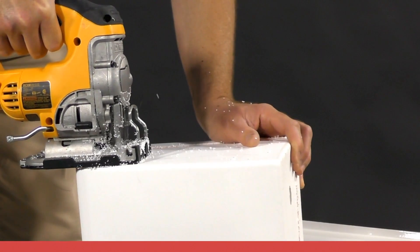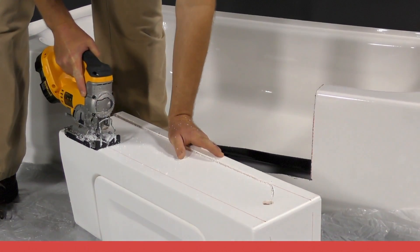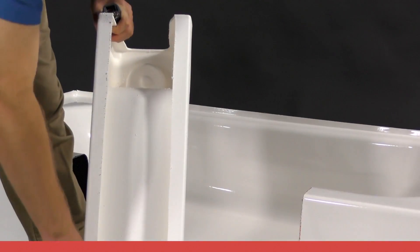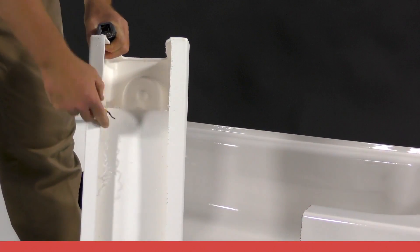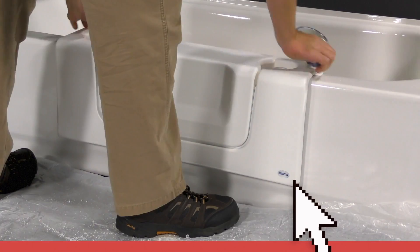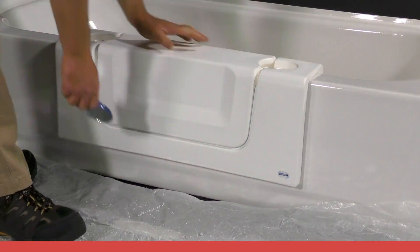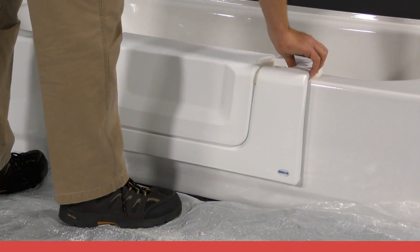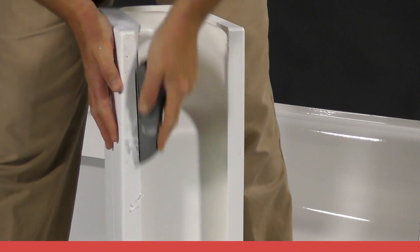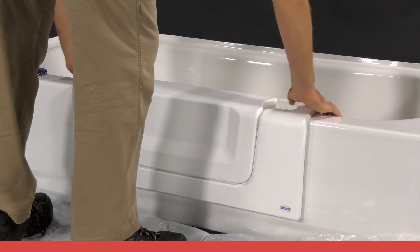On the ends, simply continue the cutting process with the jigsaw. When cutting around corners, swivel and continue cutting. After completing the primary cuts, go back and cut down the entry points. Use a deburring tool to rid the product of any remaining edges. Place the CleanCut product into position — remember, the side with the colored logo is placed on the outside of the tub. Use a small pocket mirror to look for areas on the product that may be catching and prohibiting it from free-falling onto the tub. Continue the process and repeat as necessary until the product free-falls onto the tub without catching or binding.